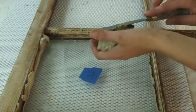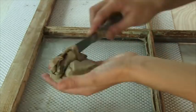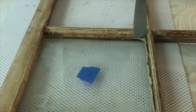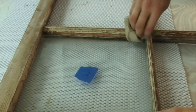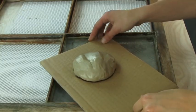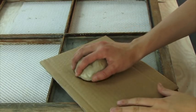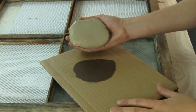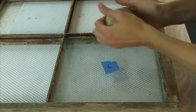Turn the window over to the interior side and trim away any excess glazing putty. The glass should be secured by your glazing pins, but be careful nevertheless. When finished, turn back to the exterior side. The putty now needs to be warm but harder than the putty you backbedded with. To create the ideal consistency, leave putty on a piece of wallboard or cardboard — excess raw linseed oil will soak into the cardboard, leaving the putty firmer. Once again, massage until putty is smooth and holds its form.